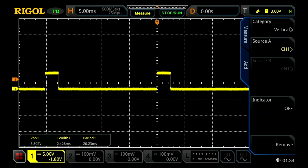As I move the signal to the right at its maximum, we will see it has a period of 20 milliseconds, and as I move it to its minimum it is maintaining the period — so right now it is only affecting the duty cycle. At its narrowest the pulse width is at 550 microseconds, and at its widest we are looking at 2.4 milliseconds. So that is our range between its left and right points.